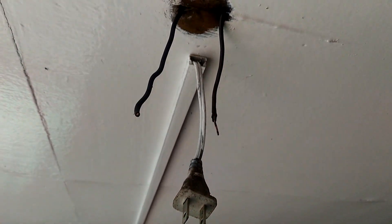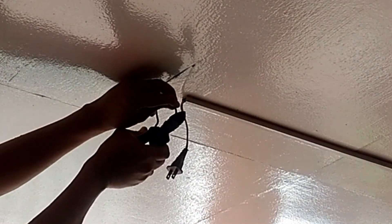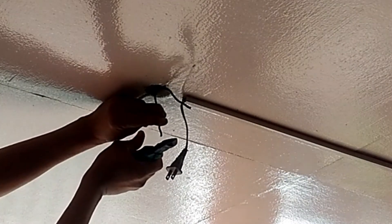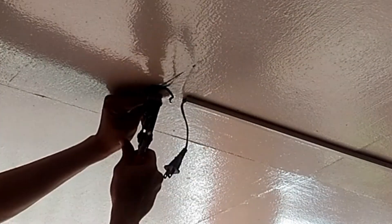What I just did was push these two wires downwards to expose enough length below for us to connect our replacement socket later — a bit of a struggle since the holes are right beside the support beam. Now we have more than enough length for both wires to make a new cut, ideally way past the burnt sections. At one point, this wire became so hot it melted its own insulation, so we cut the wire at a section where there's absolutely no sign of burning around the insulation. Then we strip both wires about half an inch from their tips.